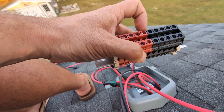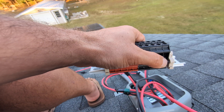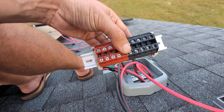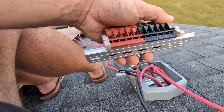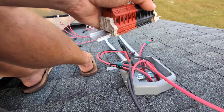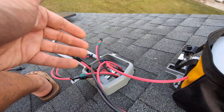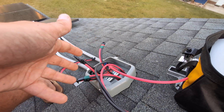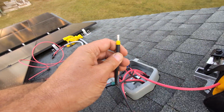This is the DIN rail I'll use. I'll alternate the reds and blacks so each side has them, then flag and tape what will be the reds and blacks of the blue arrays, and the reds and blacks of the green arrays — so there's an obvious indicator of which bars connect to which panel arrays. This should be very obvious to anyone doing maintenance in the future, whether it's myself having forgotten what I did, or someone else hired to fix it. The idea is to make it obvious what is connected where so anyone versed in this can pick up right where you left off.